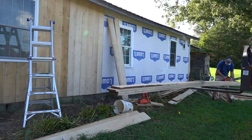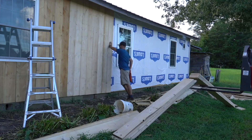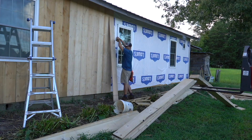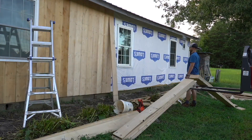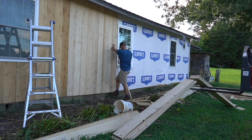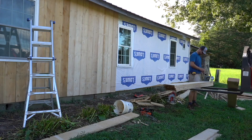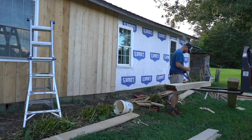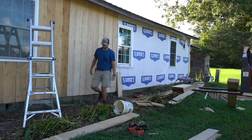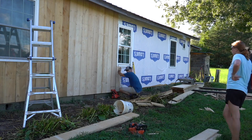I want to point out this wall right here. What we're putting up new is the exact same wood, probably out of the same log as what's on the left there. You can see a very distinct line — that's where the UV light has turned the wood on the left darker than the wood on the right. Over a several-day period it's interesting to see how quickly light changes the color of the wood: about three days and that's what you get. I'm going to give this wood a little time to mellow out and then I'll stain it all the same color. I'm going with a slightly darker stain than I wanted, but it offers more UV protection and hopefully gives this wood more longevity.